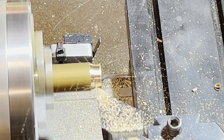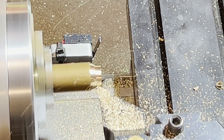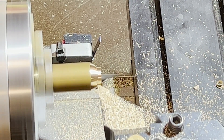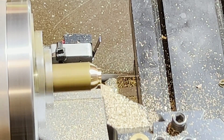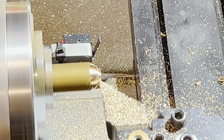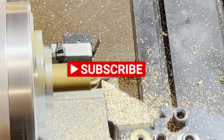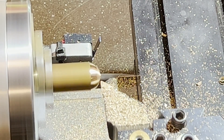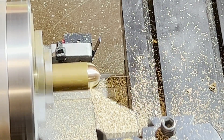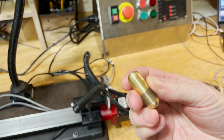But if I ever want to get a profile instead of having to cut a special tool, I could just program it in Fusion and use the CNC. You can see the limit switch I've got mounted there so I can't overdrive this — that's adjustable. That's a sealed switch; I may switch to a plunger type, but for now I think it's fine. You can see it does just what Fusion's telling it to do. I upped the stepper motor as I talked about in the last video, so it's got a little more power, and it seems fine — it didn't fault out and cut through perfectly well. You can see the surface finish came out very well, so I'm happy with that.